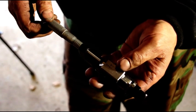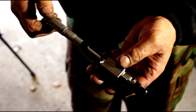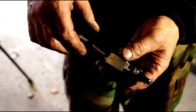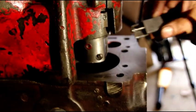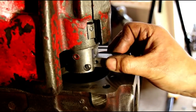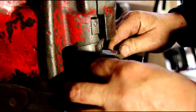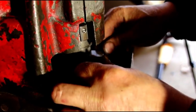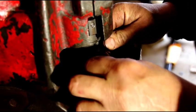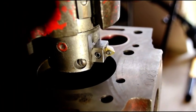We'll take it to 3-inch 144, then take 2 and a quarter thousandths out with the honing process. So that's how you set your tool — it's set right now. I don't know if you can see it on there, but it says 'top' right there, so that goes up. Put it in the machine and it will click right in there — you'll feel it. So it's in there now, and it's ready to cut our bore.